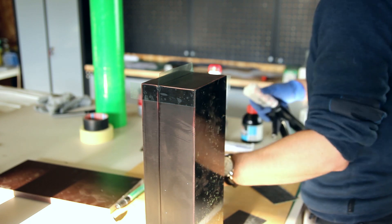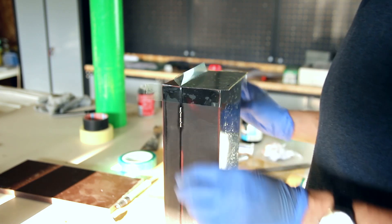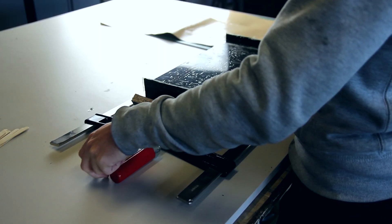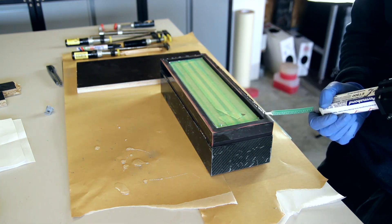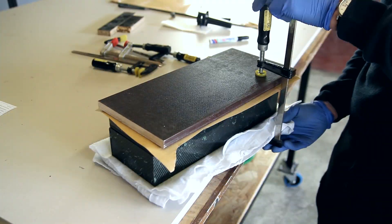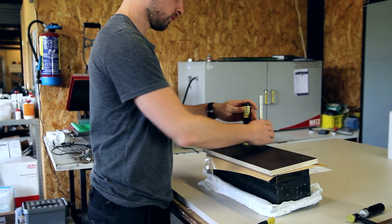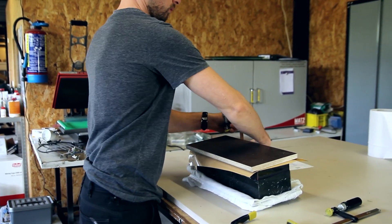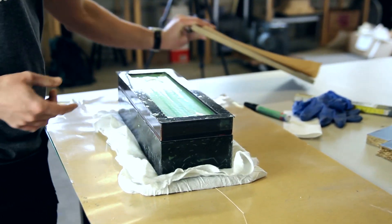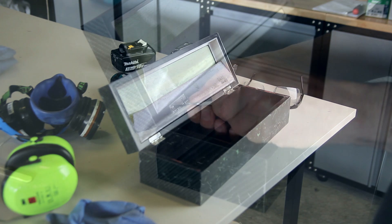The last step is flattening everything back flush with the sides and the carbon fiber sheet that was added. Keep in mind that every time you want to glue something you need a new nozzle — you'll use about six nozzles for this build. Then it's just adding all the sides until you're happy with the results. I wanted the front plates to be full plates and then added the sides. The thickness of the carbon fiber will have an influence on the visual aspect — as these sheets are quite thin it's not that obvious, but they will add a bit of thickness.